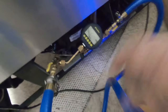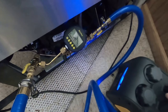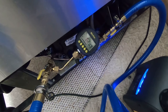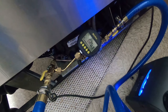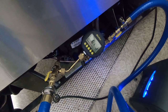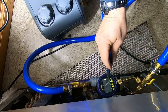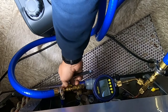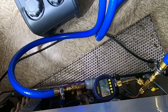Came with these monster hoses. At 21 minutes it's only hit around 600 microns—I valve it off. It rose up to about 1,350, then it dropped down to about 0.8–0.9 microns per second on a rise rate for the blank-off test. So the only thing that's left in there now is refrigerant. If there was a leak it would have just kept on rising. We're at 443—going to go ahead and shutter back down here. I've already done my blank-off test once before, so I know it's going to rise some.